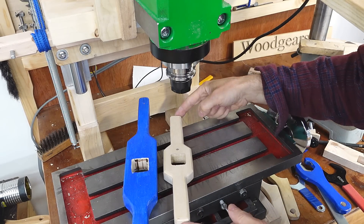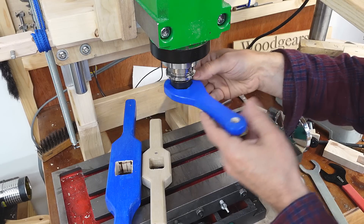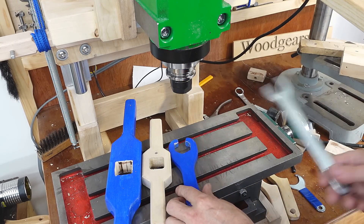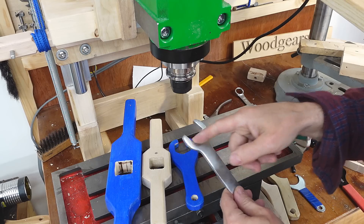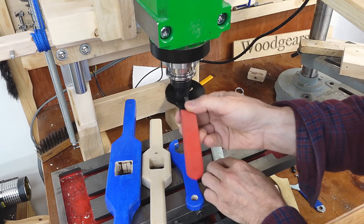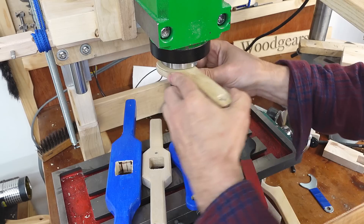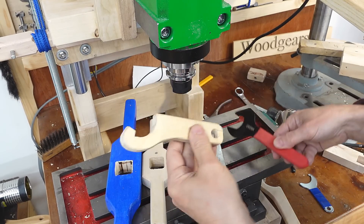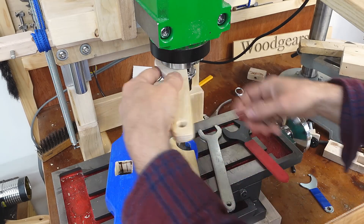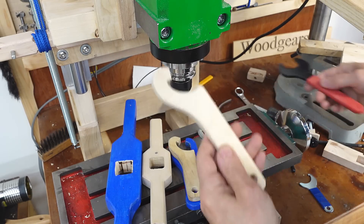This wrench is far from the only wooden wrench I've made for this machine. There's also this wooden collet wrench, which turns out to be not quite strong enough. I realized I could just grind open one of my router wrenches to use as a collet wrench, but by that time I'd already ordered a proper collet wrench. I also made this wrench to hold this part against the force of the other wrench, except this one turns out to be too short, so I just made a longer one, which allows me to apply lots of torque — so this one is quite adequate.